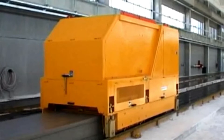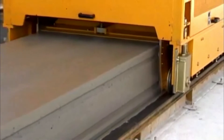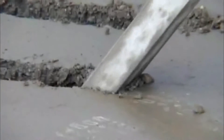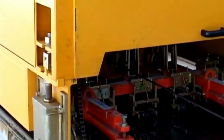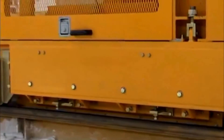Always at the centre of research and development by the internal technical team, the Nordimpianti extruder has unique characteristics of reliability and functionality. With electronic control, the Nordimpianti extruder produces elements by advancing on the production bed without constant monitoring by the operator, leaving him free to undertake wet concrete work if necessary. After the concrete is discharged into the feeding hopper, it is forced into the mould chamber with Archimedean screws that rotate and oscillate in synchrony, compacting the concrete and allowing the machine to advance on the bed with diverse speeds depending on the height of the element being produced. All the mechanical components driving the tube formers, the side formers and the Archimedean screws are mounted in an oil bath. This permanent state of lubrication cuts production costs by reducing servicing and expensive maintenance.